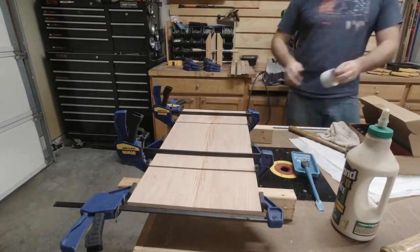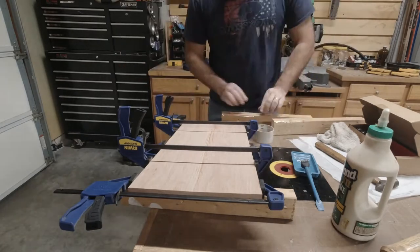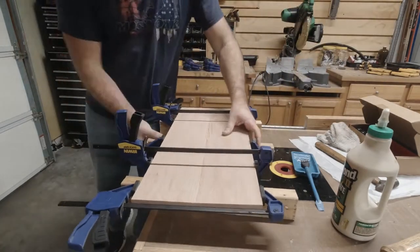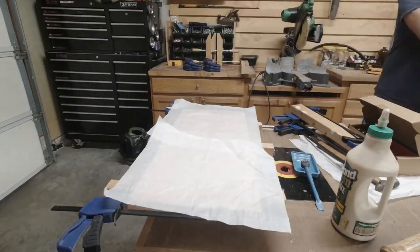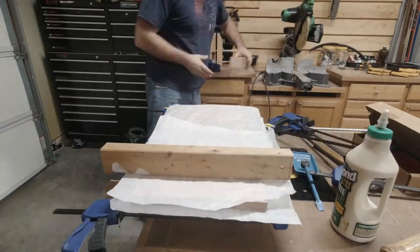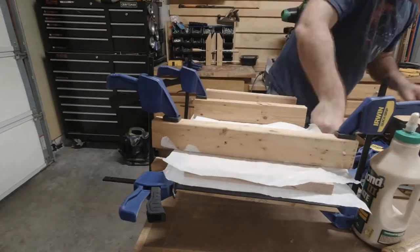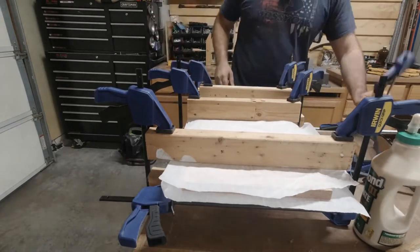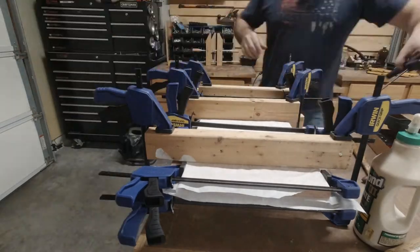After I have both boards together — I do have to make two of these — I made caul boards from old scrap. That's just packing tape on them, which will keep the boards from gluing to the caul boards, and wax paper in between each board to keep them from gluing to each other. The caul boards just keep the boards flat during the glue-up. A lot of times when you clamp boards width-wise you'll get kind of a curve into them, and the caul boards will reduce or eliminate that depending on how well you clamp.